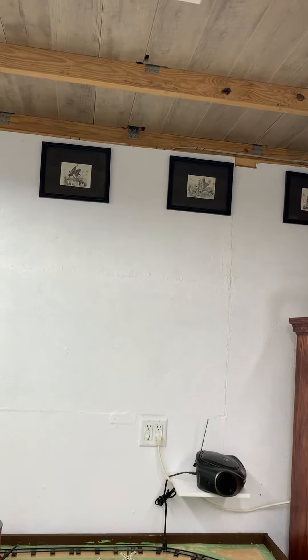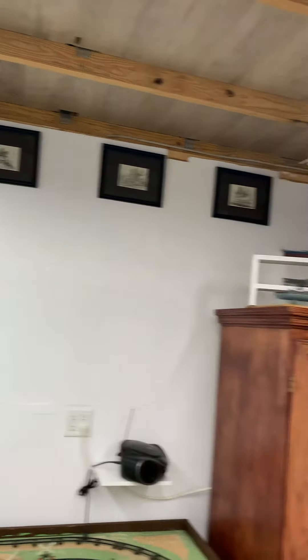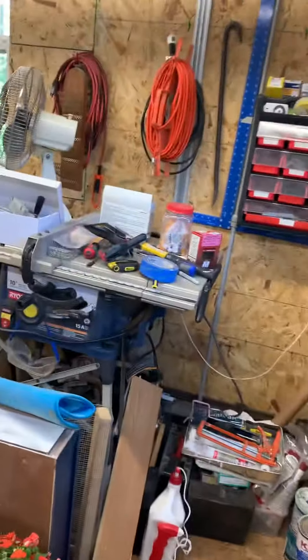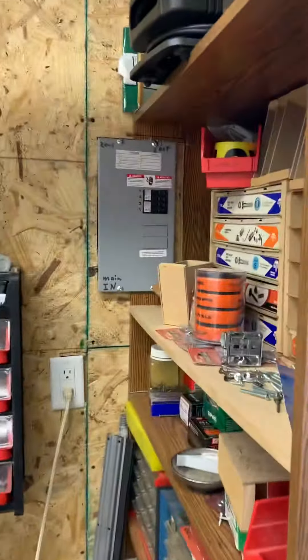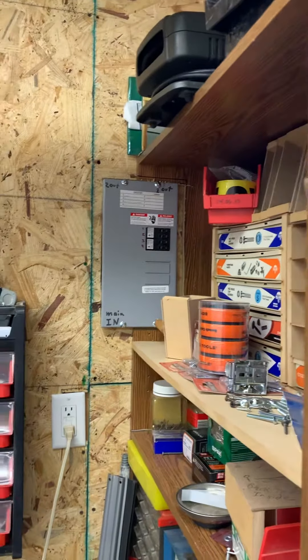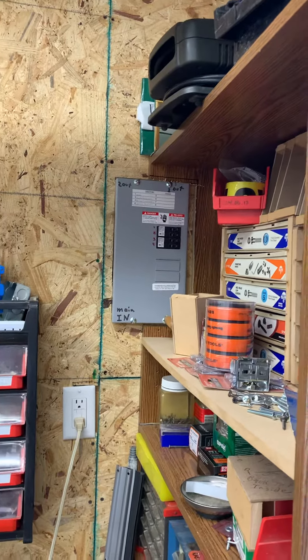The electric coming out here — I'm almost confident it's not the appropriate size wiring. This is our panel. I opened that up and we just got 8-gauge coming in, so that ain't gonna do it. He's got to have an electrician or our electrical company come out and take a look at that, see what they need to do.